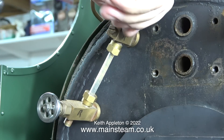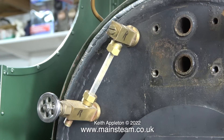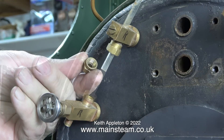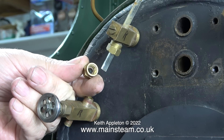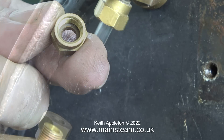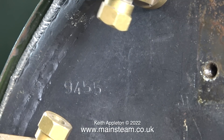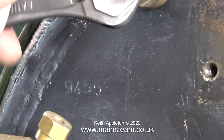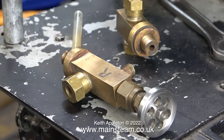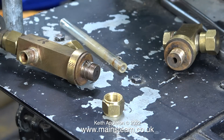The regulator went into the cardboard box with the other parts. Now it's time to dismantle the water gauges. I do not intend to use these because they are not of the three-cock type, which allows isolation if the glass gets broken. I've already sourced some replacements — they are of extremely good quality but unfortunately not cheap. Once I remove the water gauge glass you can clearly see the number stamped on the boiler: 9455. Looking at this boiler I'm pretty sure it was professionally made, but not by one of the model boiler maker specialists.